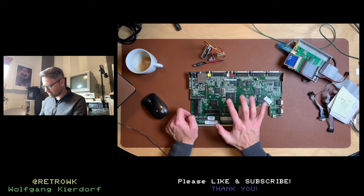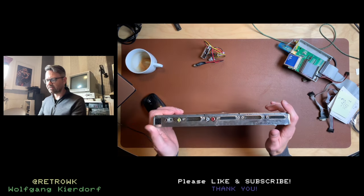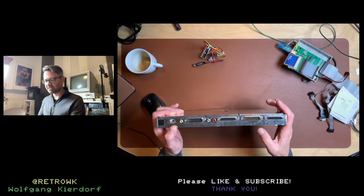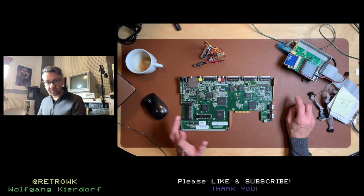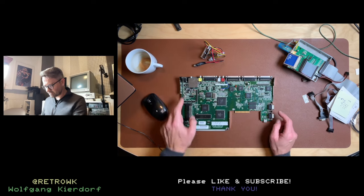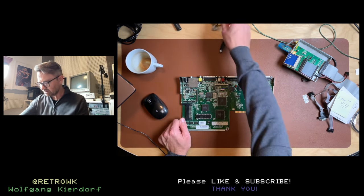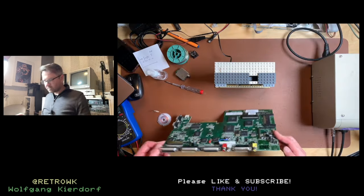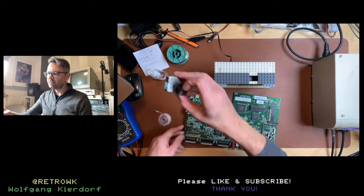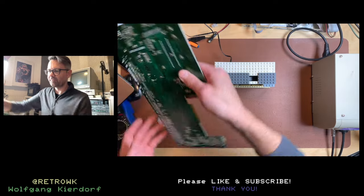Let's get this out of the metal casing - you'll see it through the back of the console. I went the lazy way and didn't make specific port cutouts; it's just one large cutout. You can also use the case for a Raspberry Pi, MiSTer, or anything like that. Let me get this out and desolder the power supply plug, the two joystick ports, and maybe the RF modulator. Okay - I did remove the RF modulator and the power socket, which was pretty uneventful. Now to test if it still works I have to connect my Pico power supply.